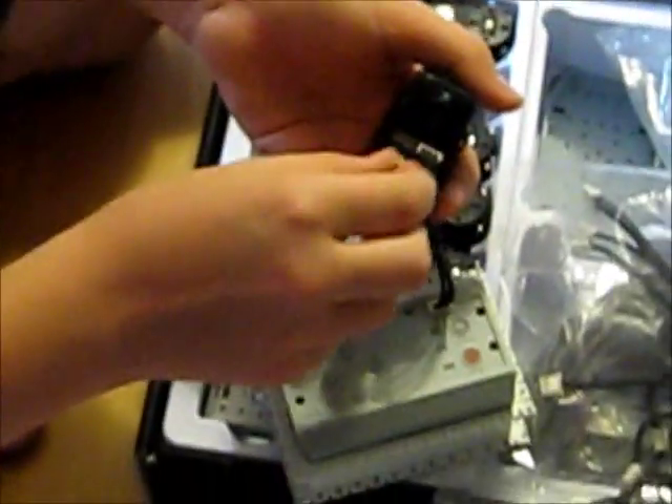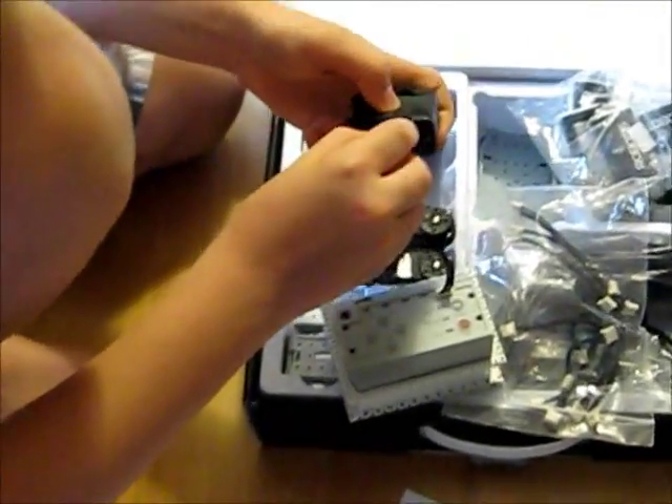About these motors — you can see it's only got three bus ports to plug them into. However, if you look at the motors and the sensor, you'll notice they have two ports, and they can actually be daisy-chained. Because each motor has its own built-in microcontroller, it can output serial commands to specific IDs — each motor has its own unique ID. So I have motor ID1 and motor ID2 both plugged into the same port and into each other, and I can control them individually.